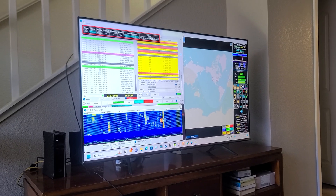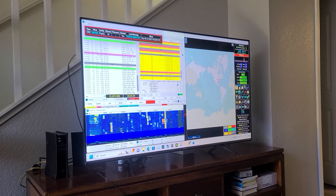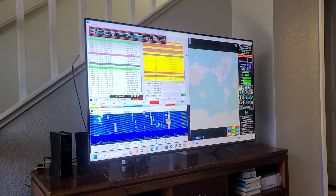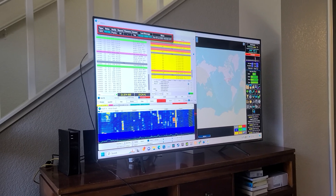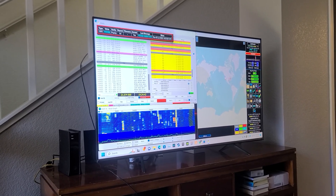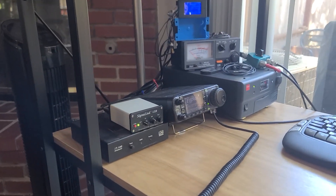It also works great single sideband. So if you're looking for something to set up, this would probably be a good idea — something to give a try. It's got under 1.5 to 1 SWR on 40, 20, and 15 meters. On 10 meters I do need to use a tuner — guessing it's probably because of the way I've got it roped around the backyard in a circle.